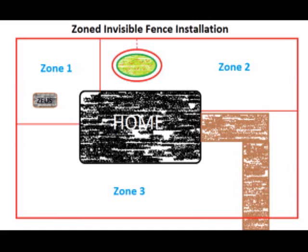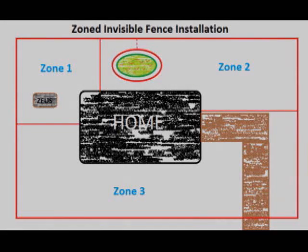In an invisible fence system, the zones are actually a buried wire that acts as a large closed-loop radio antenna. The dog wears a receiver on his collar that notifies him when he is close to the antenna by giving a series of beeps. If the dog should continue to walk closer to the fence, then he will receive a high-voltage shock to encourage him to go back. When two wires in the antenna are twisted, the signal nullifies itself for that section of the fence and the collar is not activated. This makes it possible to have multiple zones enabled at the same time, because the borders where the zones meet will not block the dog.